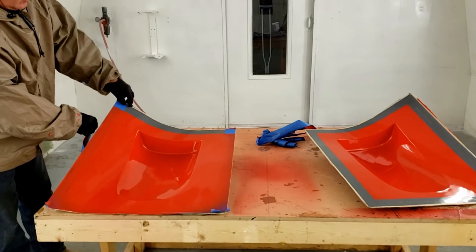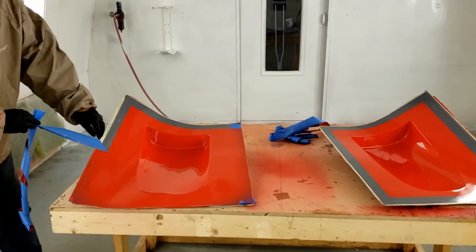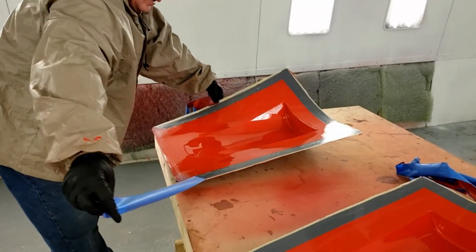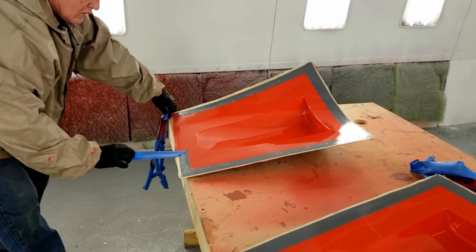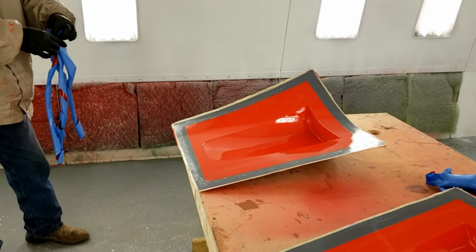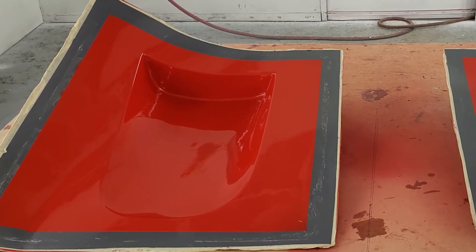After reaching the final thickness, remove the masking tape from around the edges to allow for tacky tape. Also, immediately disassemble and thoroughly clean the spray gun with the proper solvent, as the short pot life and hardness of Element Xtreme will clog the small orifices of a spray gun. It is also possible to use a gel coat cup gun with a number 2 or number 3 tip.